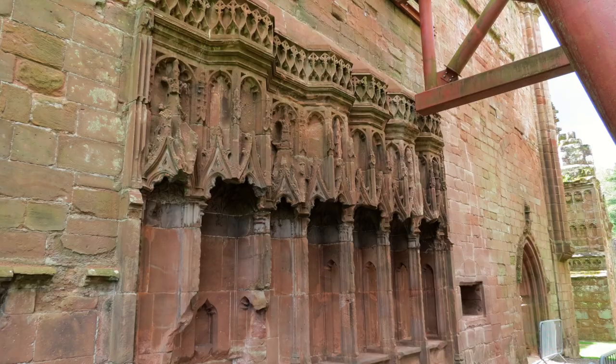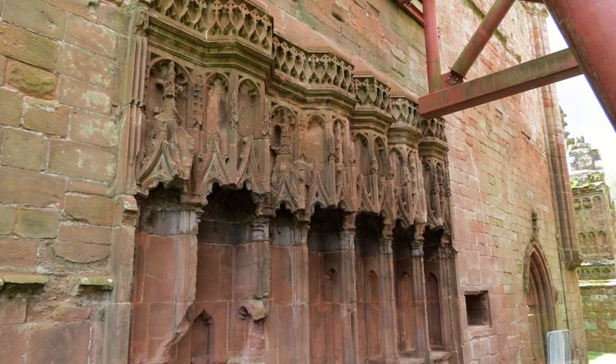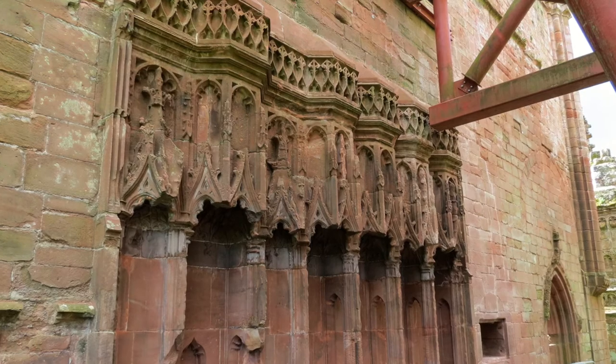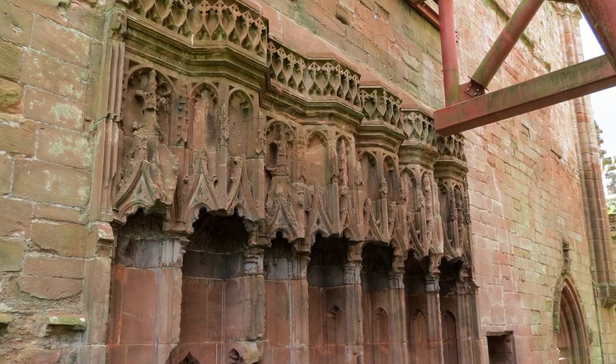Surprisingly, about 10 foot down, there were just five oak logs. Five bits of wood, next to each other, and then they built this on top of it. So it did quite well, really. It did amazingly well. Only as it started, the water table changed. The timber baulks were in a clay liner to protect them, but obviously over time that degraded, and then as the timber started to rot, that's when we had the rotation of the walls.